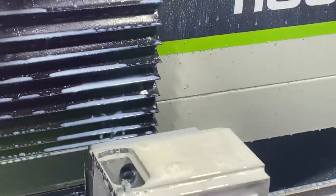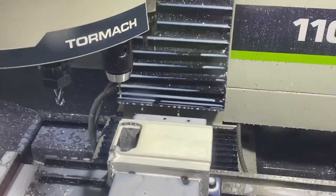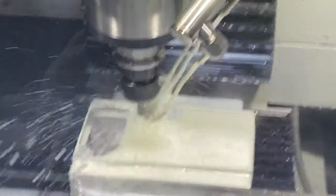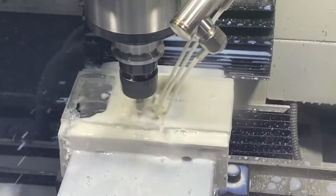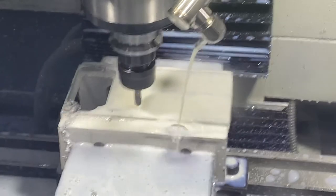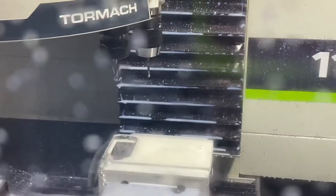Next tool path, it's going to go grab my 90-degree V cutter here. Sorry about the cabinet door — let's put this overhead. I'm going to crank the RPMs up. Something I should have done — I forgot to raise the RPMs up and I'm going to end up crunching the tip off of that 90-degree.